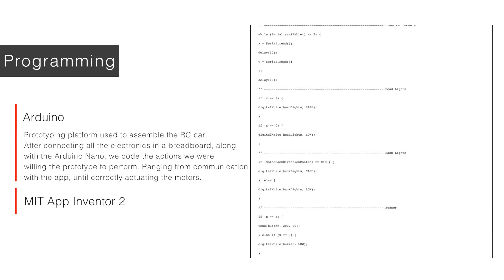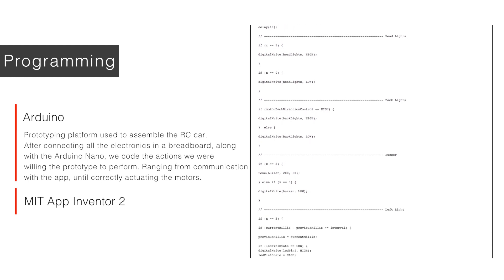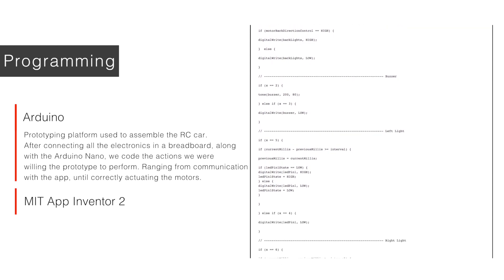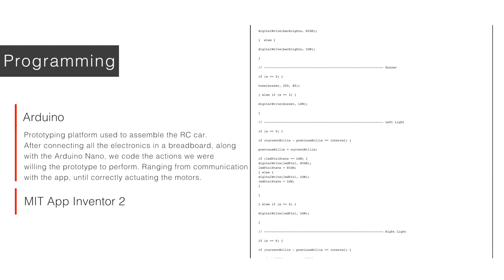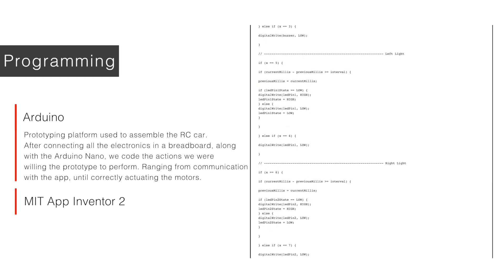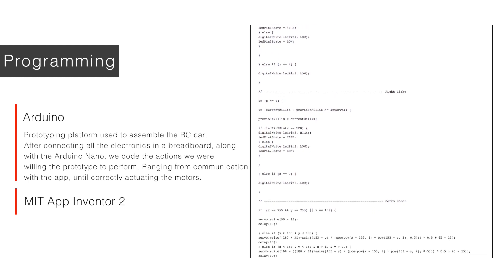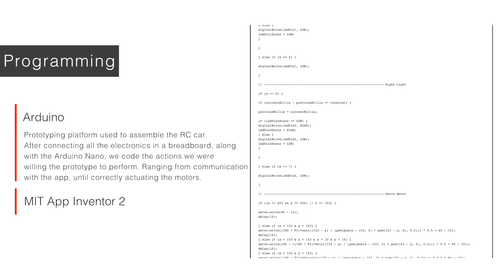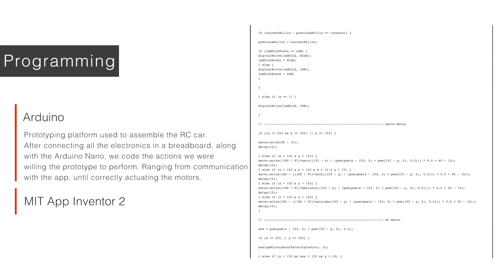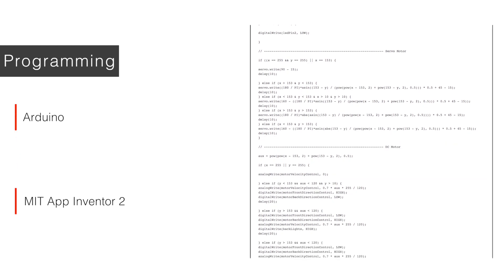The following sections turn on or off head, back, or turning lights upon the presence of a specified set of enabling conditions — same for the buzzer. The servo motor operates in a slightly more intricate way: it responds to the incoming values from the position of the red circle belonging to the joystick control in the car app. Trigonometric relations were applied to convert this position into an angle, and the servo is limited to a range such that wheel rotation doesn't exceed 45 degrees to each side. The last piece of code defines the velocity at which the motor axis will rotate, being proportional to the sum of the squares of each x and y coordinate of the joystick in the app.